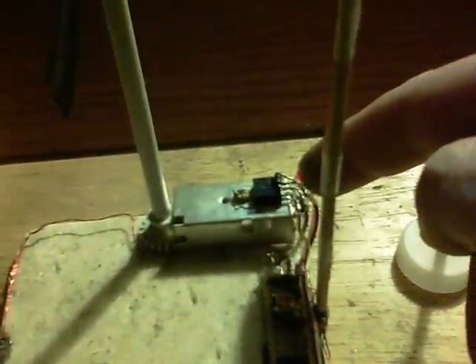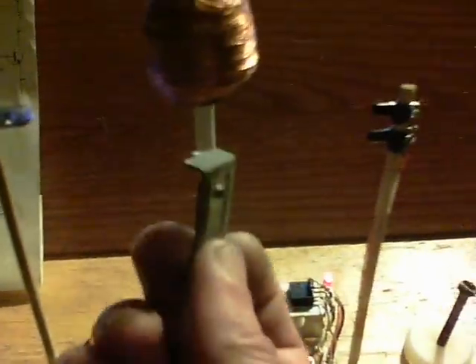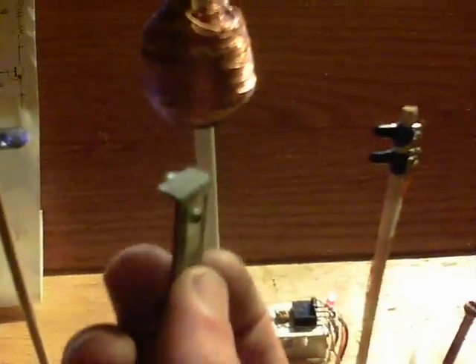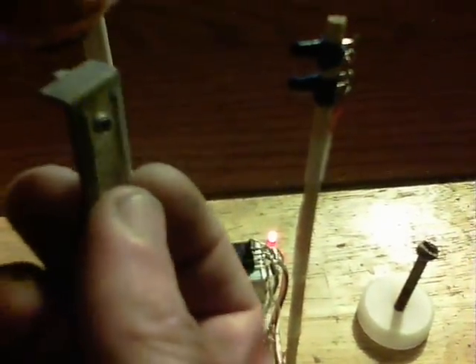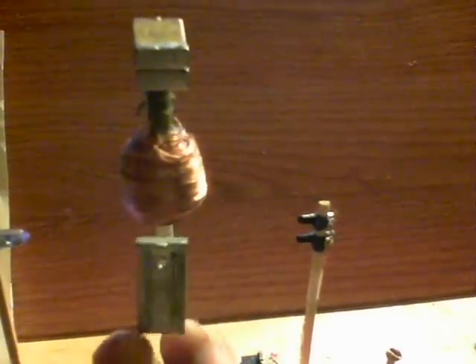The sender came from a TV remote, and the main basis is a TL072. The difference in these two is amplified and goes to a TIP120 — it's supposed to be a TIP122 but I had a 120. You can see if I take the object away and move it into the beam, that LED at the back there changes.